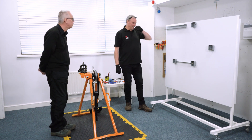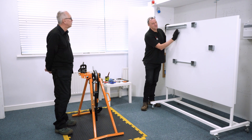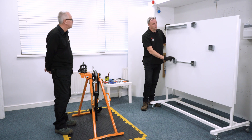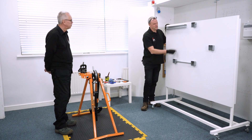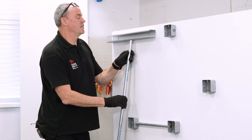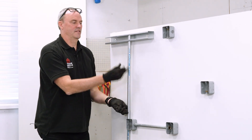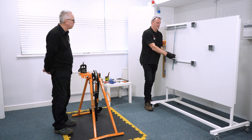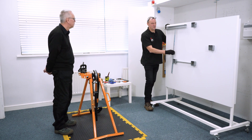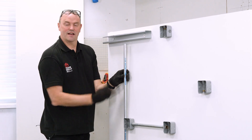What I've done here is pre-drilled this trunking which is slightly offset from the piece that we're going to facilitate connection of. Just to show you — if I put this through there you can see that it is some distance away from the one below, and you wouldn't just fasten that together because the threads won't go on straight; they're never at an angle.